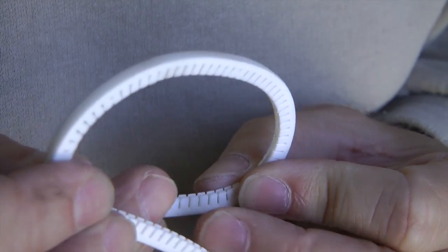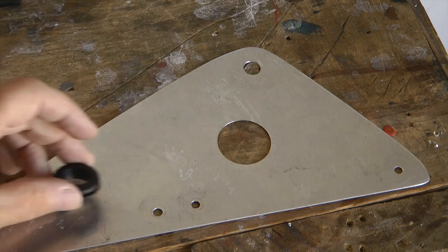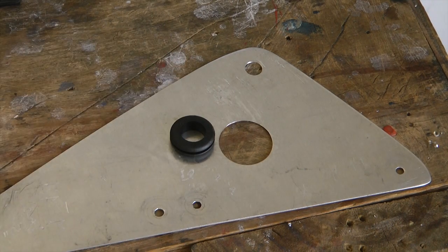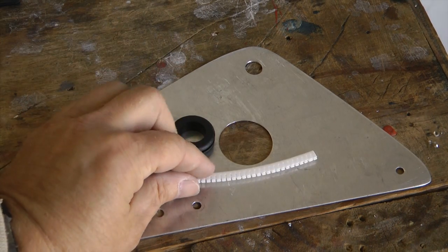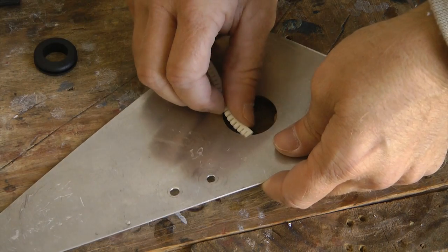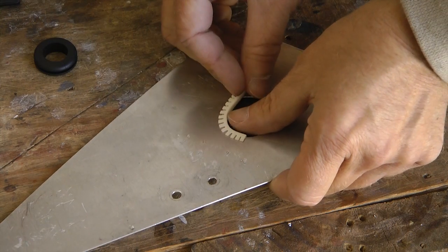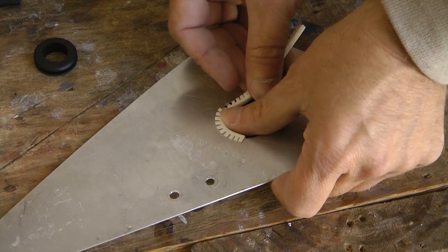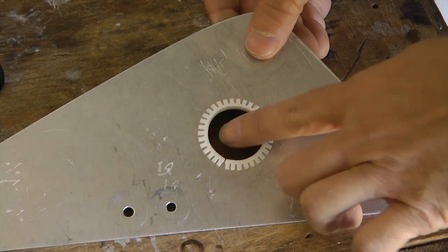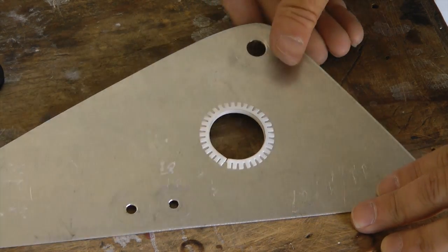It is available in various sizes to address whatever edge thickness you want to cover. The grommet I am demonstrating was made for about 25 thou to about 36 thousandths, which matches most of the edges in many metal aircraft. It cannot be beat for covering large holes, irregular shaped holes, or just any edge that needs to be covered to protect passing wires and cables.